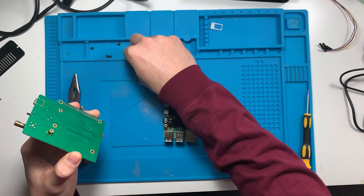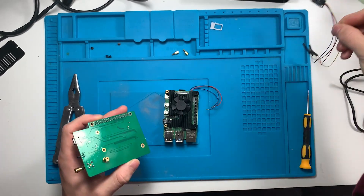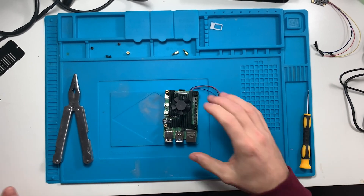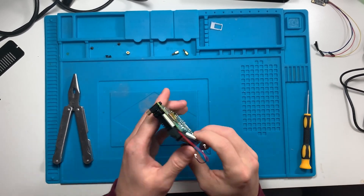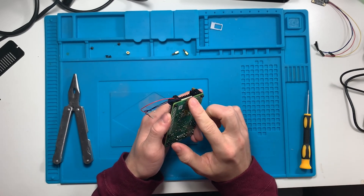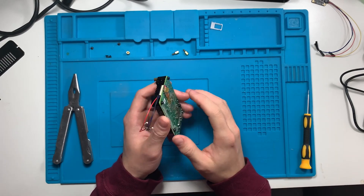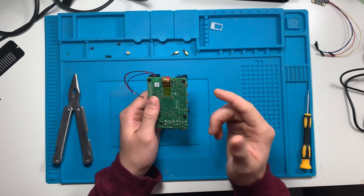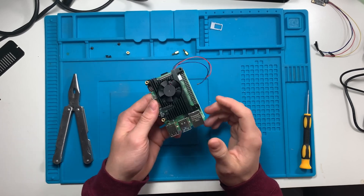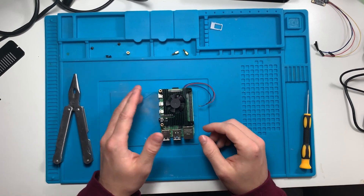There was one of these little risers that I actually took off, which I use for the BME sensor — if you want to do that, you can take it off now or later, it's up to you. Now that we have the actual Raspberry Pi, we have the SD card, and this SD card has all the SenseCap information on it. What you want to do is make a backup of everything on it so that if you ever want to go back to mining Helium, you still have the config file. Other than that, we can go ahead and start modifying this to work for our PiFi device.